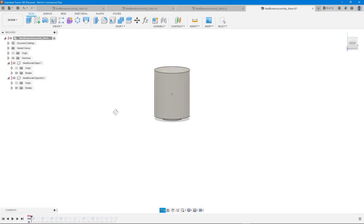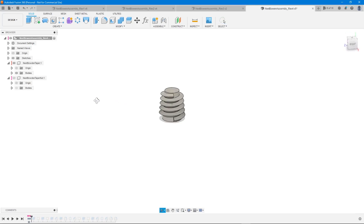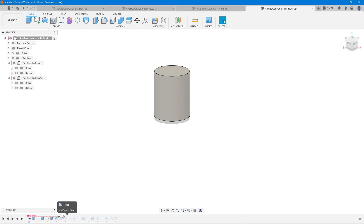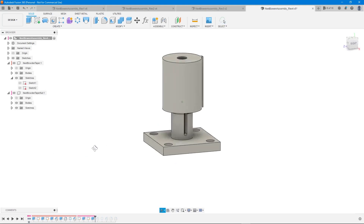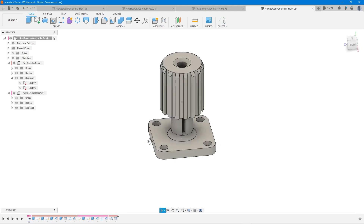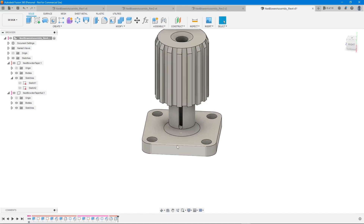Jumping over to Fusion 360, when we roll back the timeline we can see that each part starts with a taper and a nut. I did some example operations so feel free to add your own mounting option. You could even use an M6 threaded rod with a 2mm hole drilled inside to mount to an existing printer, because those pneumatic fittings are usually M6. The taper part is quite hard to make and it's not made in Fusion, so if you want something in particular you can always ask — and leave in the comments what you think about this mounting option.